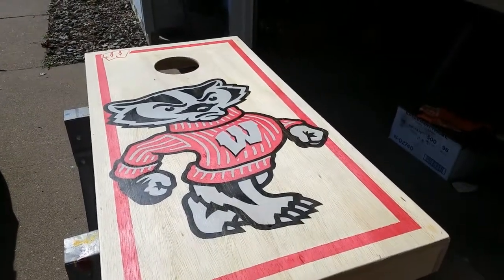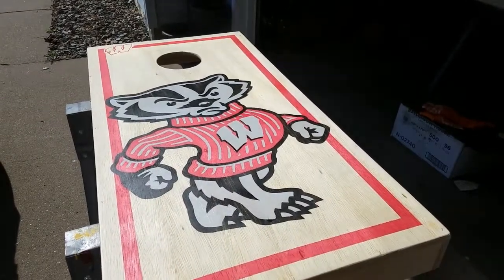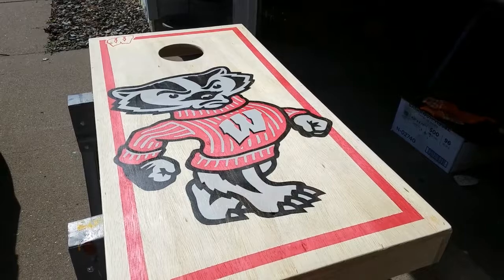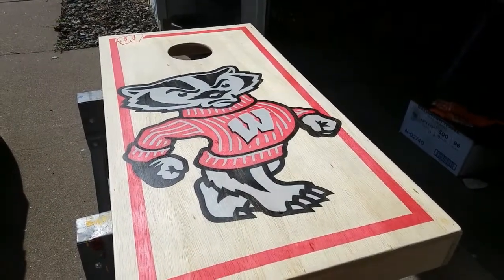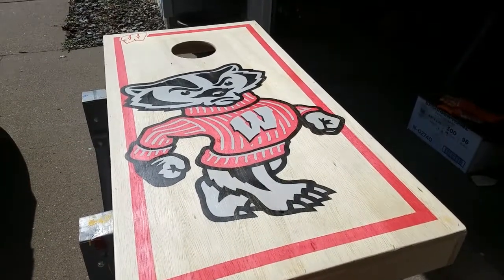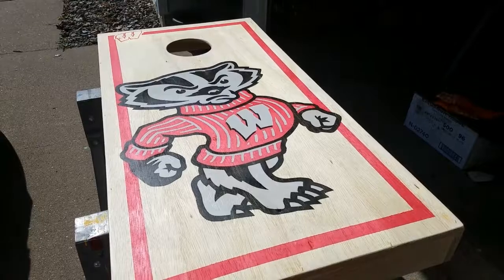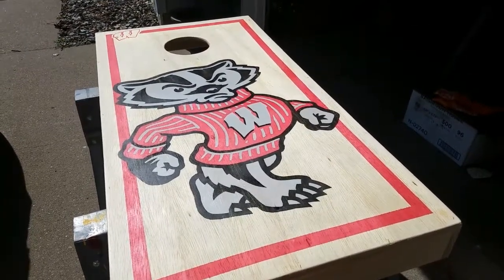I did spray a coat of polyurethane on already — just like a spray paint kind of thing, but polyurethane. I did that because when you poly and then you wipe with a brush over the stain, it kind of smears and streaks a little bit. So I wanted to get one layer down of poly, and now I'm going to use a roller to put some down and then a brush to kind of smooth it out. We'll do three, four, maybe five coats — we'll see what we need. Let's see how they look in a few minutes.